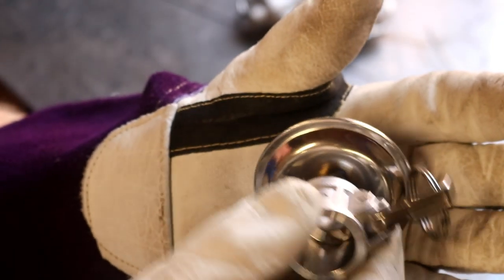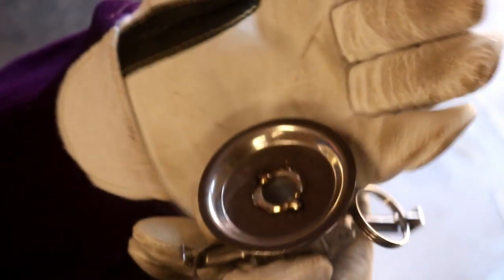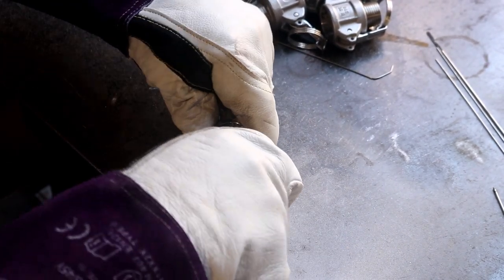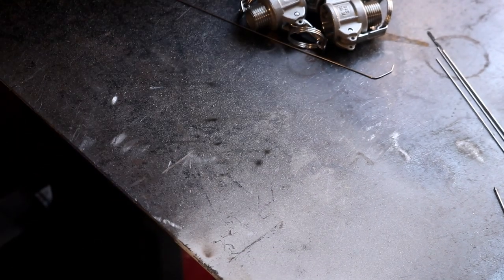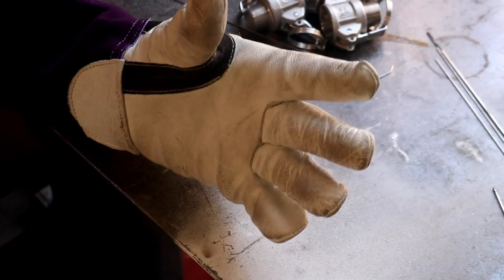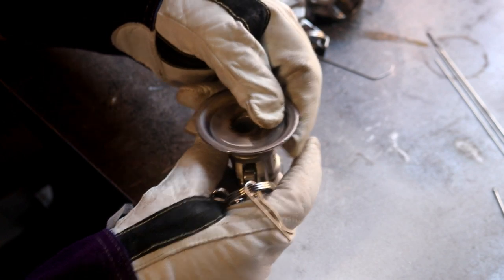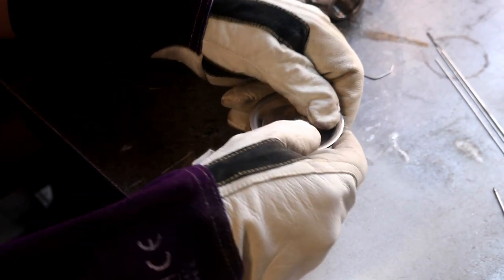There we go. So there's no coking on the outside, which is perfect. It hasn't burnt through, it's just literally melted the two tacks on the back side, which is what we're looking for. That one's a little bit wonky, but the good thing about the two tack system is we can give it a ding with a hammer and straighten it up if we need to. But the tolerances for a kit that you're making for yourself are a lot sloppier than if we were going to be selling this equipment to somebody. So I really don't care, frankly, if it's a bit sloppy.